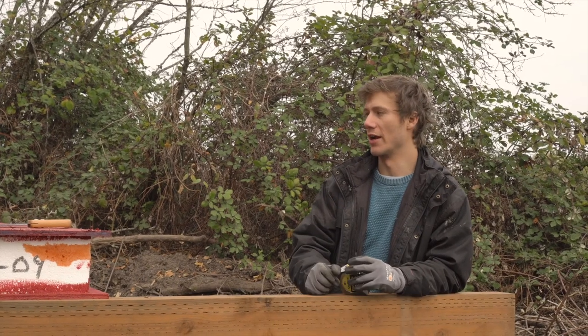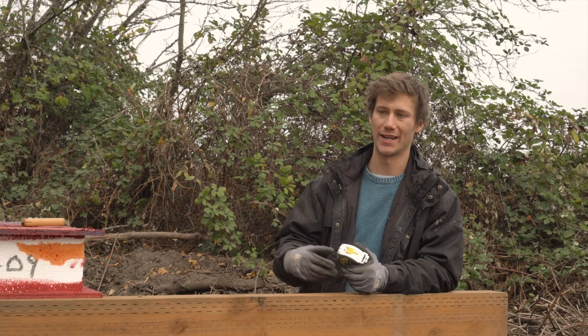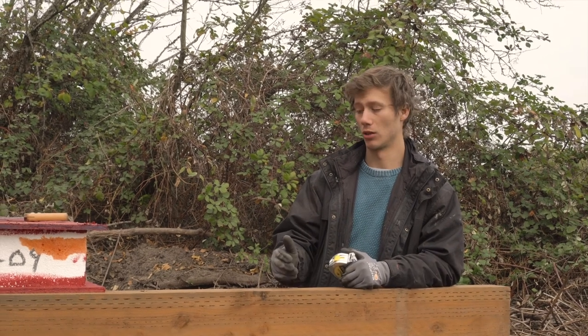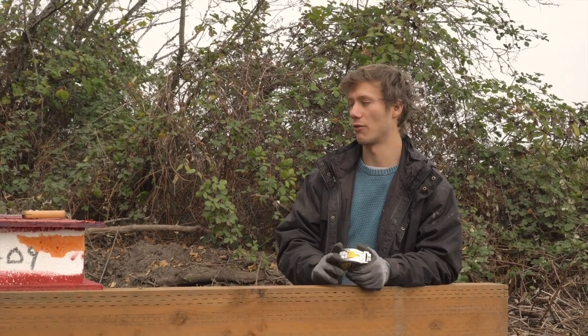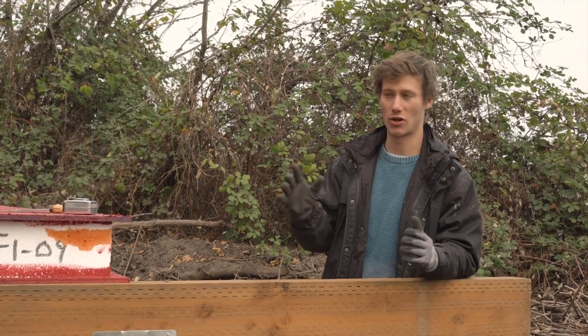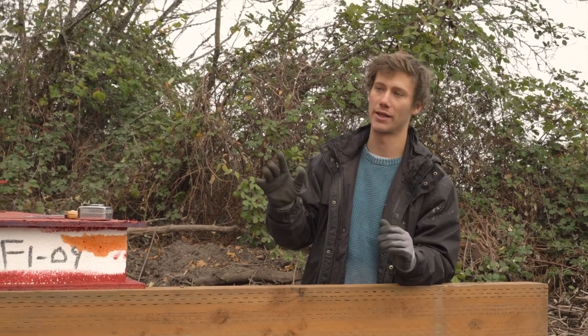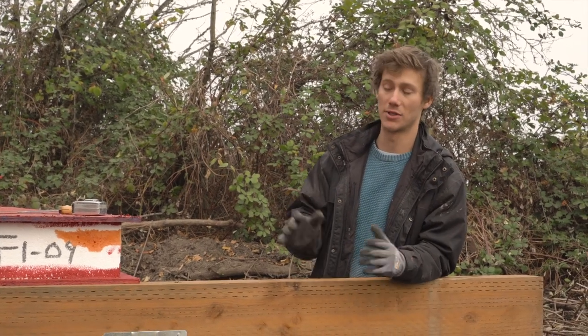When we built this subframe, we intentionally put in longer beams because after talking with some people, they said that you want these longer than what the engineering plans call for. Then we took the SIP panels and dry fit them in. And dry fitting means you're not screwing things in, you're just setting it in place into position.